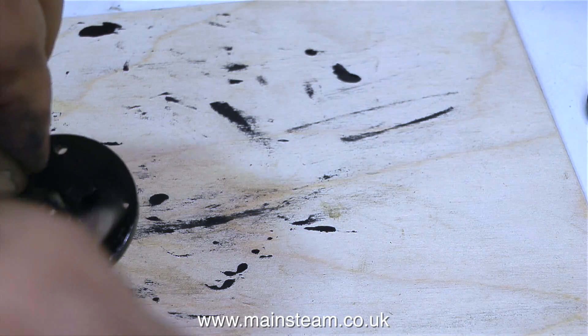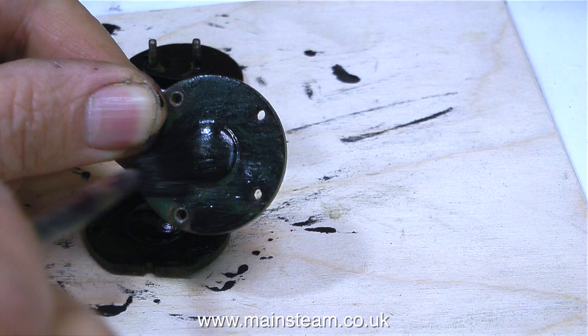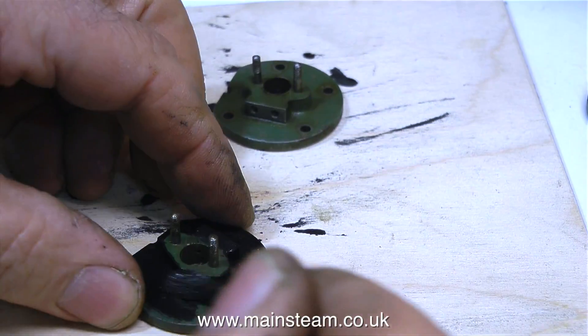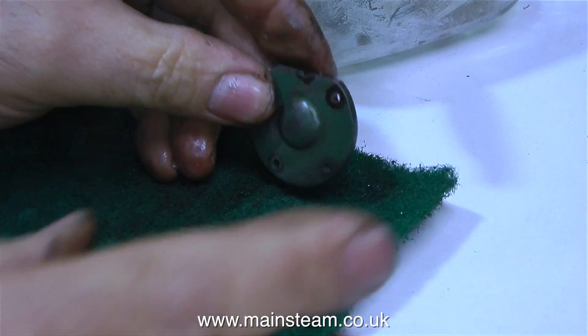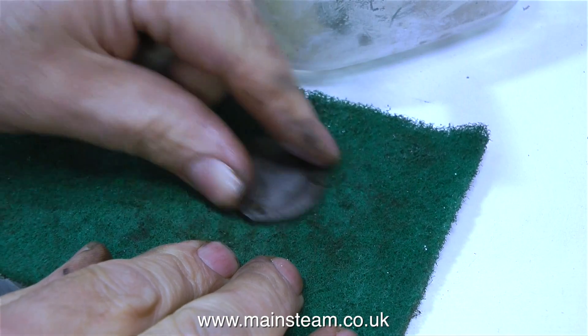Now it's back to the painting — first the lower cylinder covers, and then the top covers. But really, I'm not happy about this, I'll stop it. Normally I would never paint cylinder top covers or cylinder lower covers, because I don't think they should be painted — they're often not painted on the full size. The only reason I'm painting these is because they were painted in the first place. So it's now time to use my unpainting brush and remove the paint. I really don't like it in black; I didn't like them in green to start with. So I've removed the black paint and now I'll remove the green paint, which I can't simply unpaint because it's well stuck to the metal. So I put the parts in cellulose thinners to soften the paint, and then used some Scotch Brite to remove it.